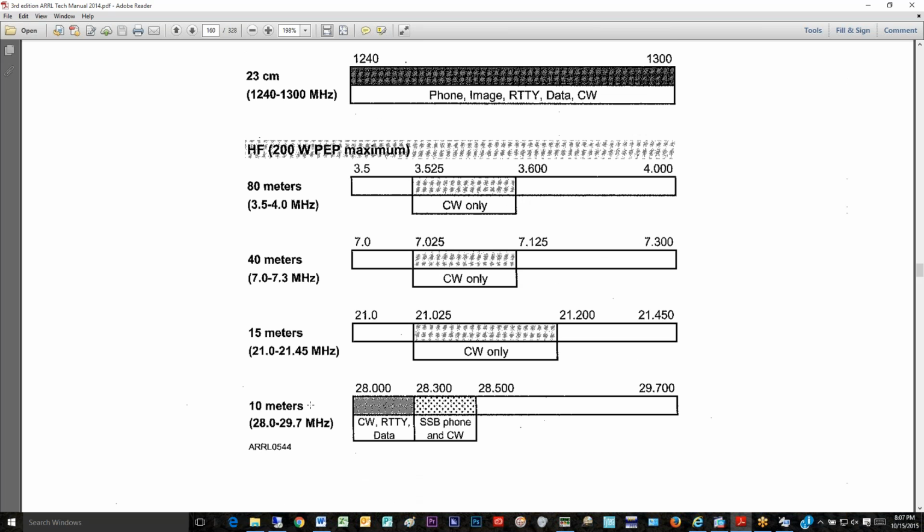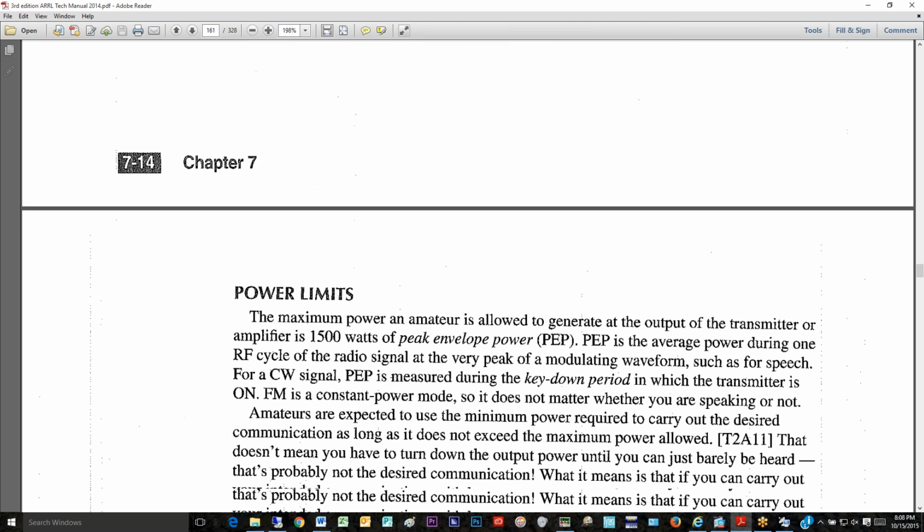You buy a radio out of the box, they normally have a maximum of 100 watts, okay? To go more than that, you will need an amplifier. And even if you buy a 100-watt radio, the limit is on radios, okay? The radio will self-limit on 2-meter and 70-centimeter. Mine certainly does. The maximum that the radio will put out on 2 meters is 50 watts, and 20 watts on 70 centimeters, okay? You don't need it. You really don't need the power, okay? And they do that so it doesn't overheat on you, okay?